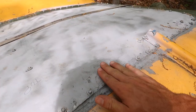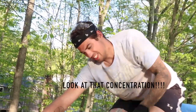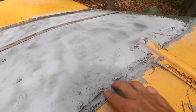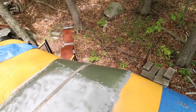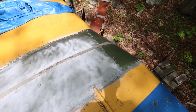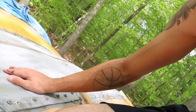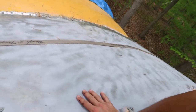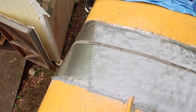I made this little bend, just hammered it. They've got these roofing nails, self-screwing, with neoprene washers on them to stop the water going in. What I did was made cardboard templates. I had footage, but I no longer have the footage. That's what the side's looking like. Once we paint the roof with the tropical white stuff, we'll fill in all the little crevices. I'm probably going to trim this back, make it look all nice. The front roof transition is done — just got to titivate it and make it look all sexy.